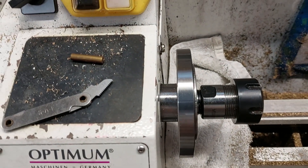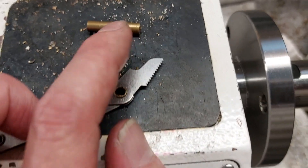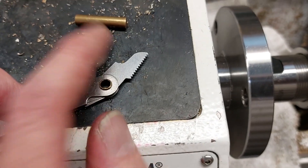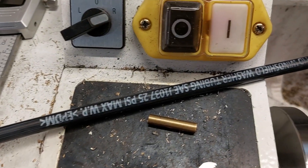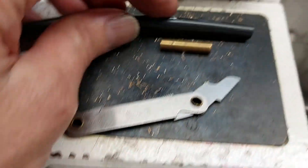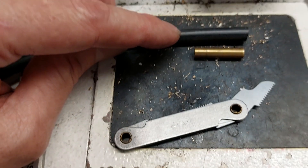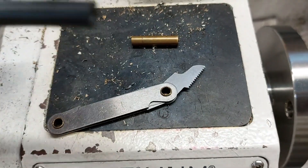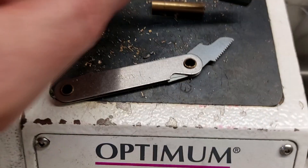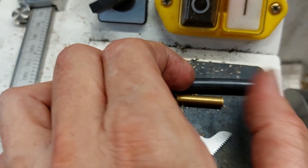I managed to turn down a handful of adapters and cut off lengths turned down to about 4.4–4.5 millimeter diameter. The hoses are four millimeters, so make sure you get four millimeter hose — I had to go out and get it. I machined off 4.4 millimeter diameter, about a centimeter long. Then I cut off three to four centimeters — probably should have done five — of tube and jammed the brass pieces in.